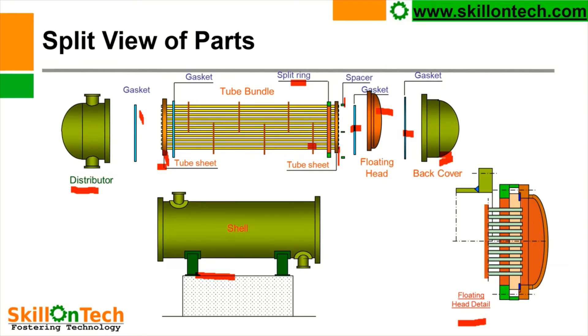These tubes are generally stainless steel, or may be carbon steel, but generally stainless steel tubes are used in process industries. If there is a corrosive atmosphere or corrosive fluid to be handled, then SS316 or SS304 tubes can be used. And if welding is involved, then SS316L or SS304L tubes are used. Baffle plates may be carbon steel or SS depending upon requirement and application. Shell is generally carbon steel, and the shell cover, floating head, distributor cover — all are generally made of carbon steel.